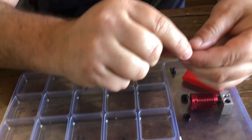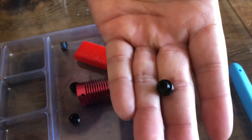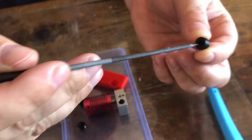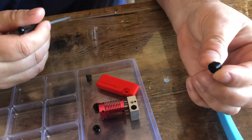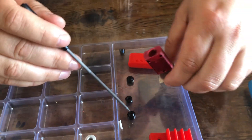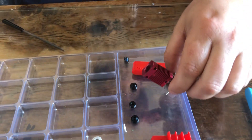So then I came up with this one. It's got two holes in it — one for the top PTFE tubing. I made a bigger size on this one; I'd have to ream that out, but I'm not worried about it because I was just prototyping it. The tip that goes inside the hot end towards the nozzle also has an indentation in it for the PTFE tubing.